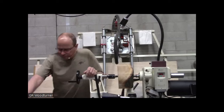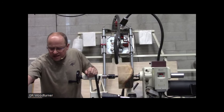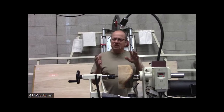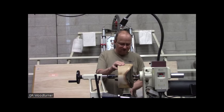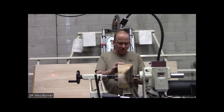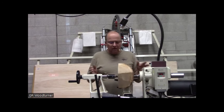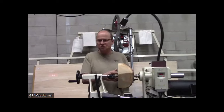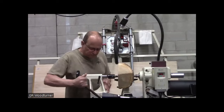You'll see here with my other bowls that they're balanced. If you have one side or one corner that's significantly higher or lower than the other, it just does not look good. So you're trying to do, before you get too far along, I'm just taking my finger and gauging where I'm at with this. A little later on, if I need to, I can make adjustments because it's just between centers. I can back this off and tweak it around.